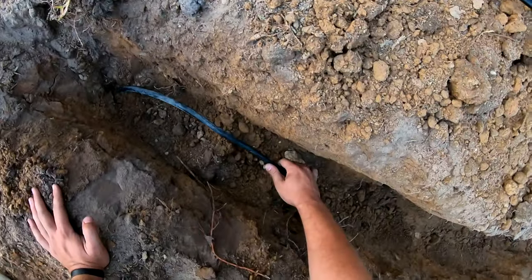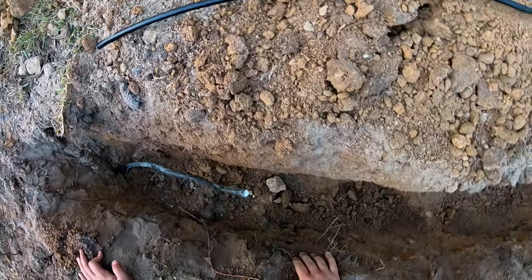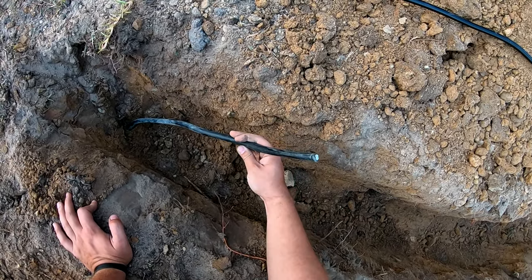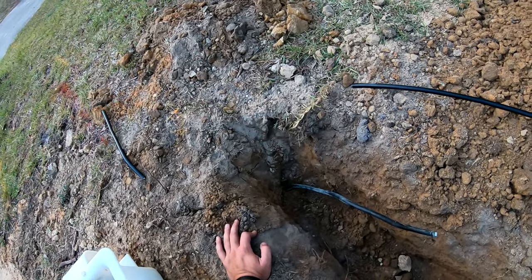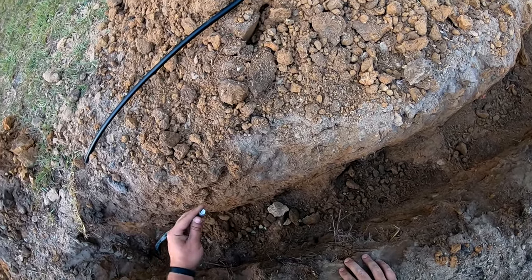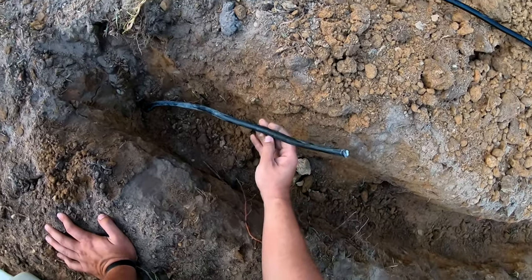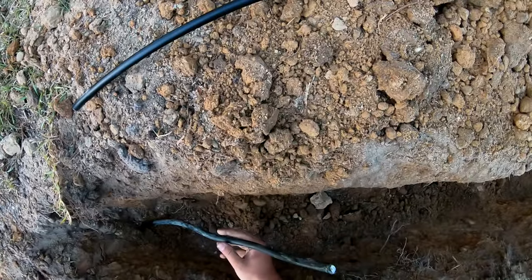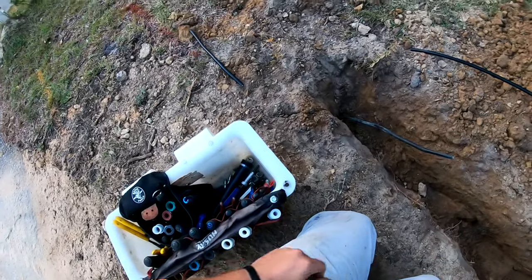Basically, a lot of times whenever cable gets damaged on a dig, you can see here, hopefully, that it's sort of flat. So you just want to cut back, similarly to how you would if you were repairing a normal underground drop. It's typically damaged further back, so you just want to make sure that you've got no cuts in the jacket and no other sort of physical impairments.